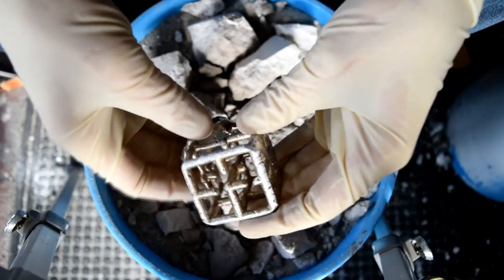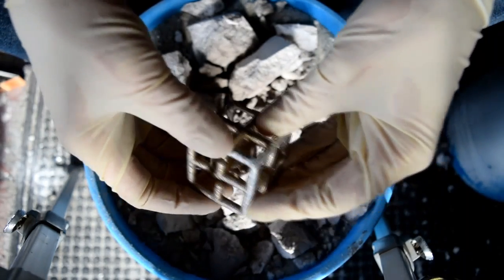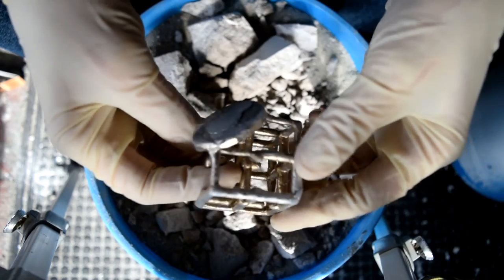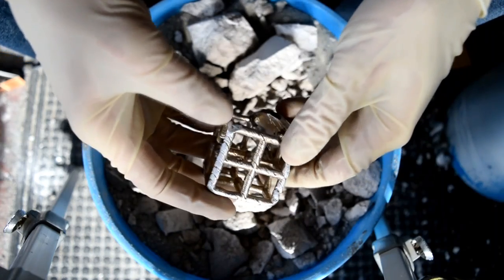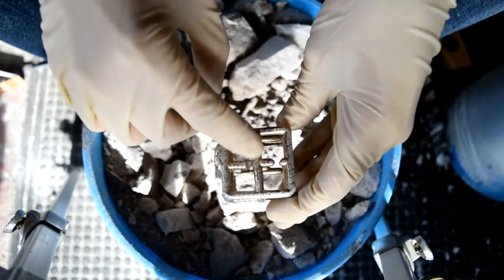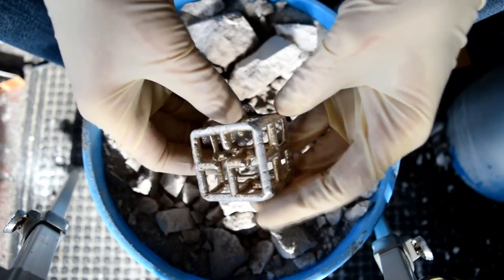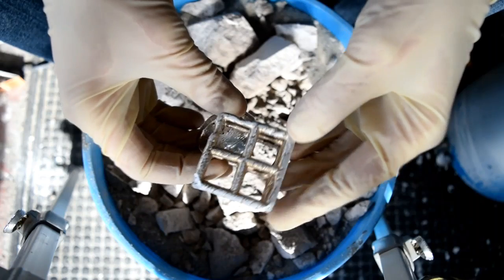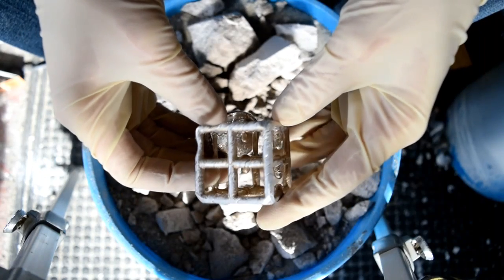Here's how it looks after I ground it down and removed the sprue and risers, and did a little bit of sanding. It had this bronzy burnished look to it — I think that was from residue of the PLA. I never got that on any of my other castings before. Maybe an acid bath or some intricate sanding would take it off, but altogether it came out fairly well. I usually don't post videos of failed castings, but I've cast this three times and this is the best result I've gotten, and I thought I'd let you guys see. I hope you like this video — on upcoming videos, tell me what you'd like to cast. If you have something from Thingiverse I can print, put it in the comments, and maybe I'll pick it, cast it, and send it to you. I hope you enjoyed this video — hit like or subscribe, appreciate it.